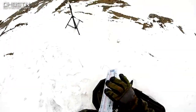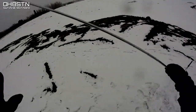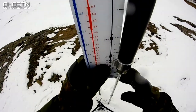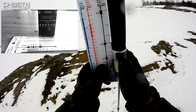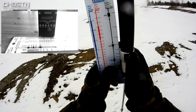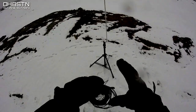A field note about the telescopic whip on the MP1: it's got an incredibly small breakdown size, which is why I carry it, but the cost of that is it being delicate. Here you can see I use the frequency guide to pre-tune the MP1DX Max. In retrospect, and having more experience with the system, I would rather use the FG1 frequency guide for getting close to the band I want, then use an SWR meter with an SWR bridge or AB antenna switch to fine-tune the SWR. It's all about reducing unnecessary fiddling in the cold.